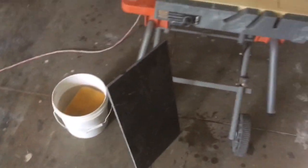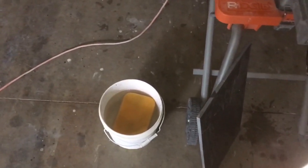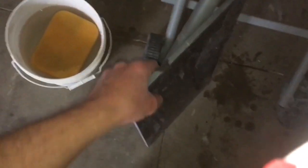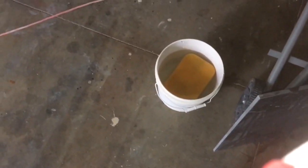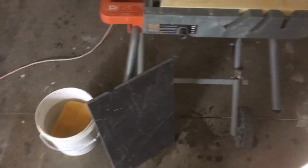I also have my bucket of clean water, because after I cut the piece I like to clean the back of it off. Marble and natural stone already comes from the manufacturer or cutter with a powder on the back anyway, and then especially after you run it through the saw you've got dirty water all over it. I like to clean it off and scrub the back just a little bit so you get good adhesion with your thinset. So, let's get to cutting it.